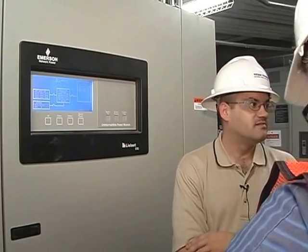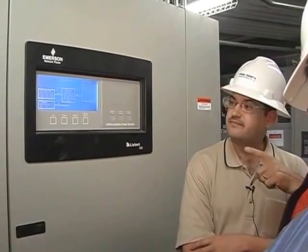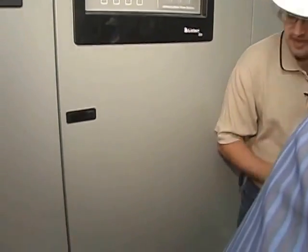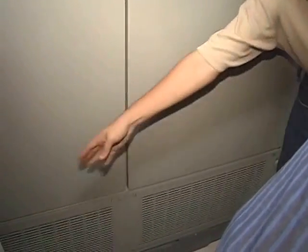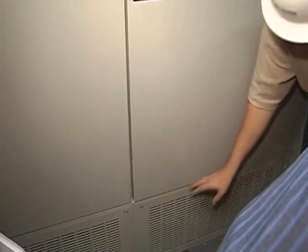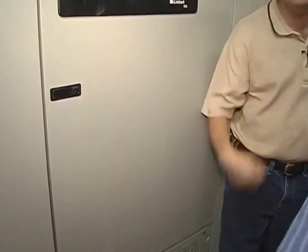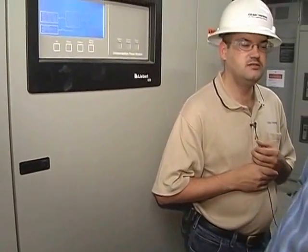The breakers are all labeled, the battery breakers are all labeled. Regarding the filters down here — they should be replaced as needed, we recommend about once a month. To get to them, they've just got two screws on each side; open them up, and they tilt out so you can just slide them out. Only use fiberglass filters — not pleated. Just the standard fiberglass with a cardboard frame. If you restrict too much air, then you can't suck air into the UPS, which is not good — it'll burn out the fans. So no fancy filters, just the cheap fiberglass ones.